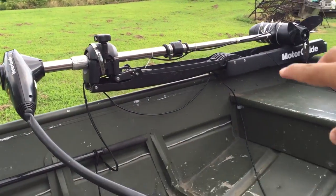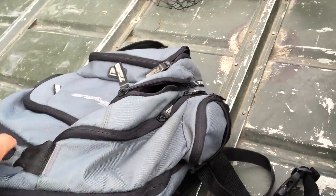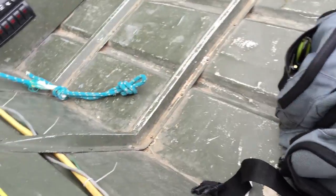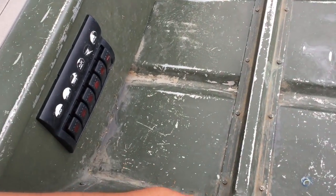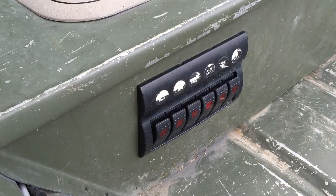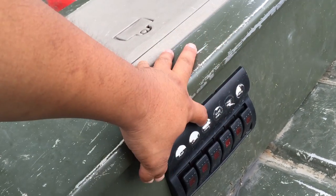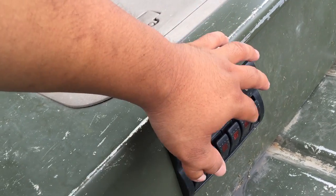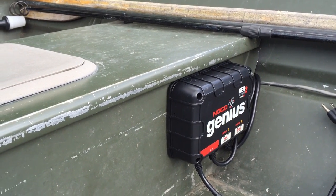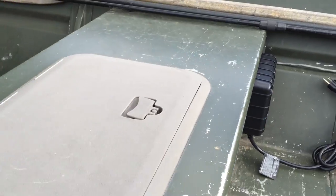For the electrical wiring, the light wiring goes one way and the trolling motor lights and everything else come in through the ribs on the other side. I'm not exactly done with it — I still need to put some wire loom or jackets on the wiring once I'm satisfied with the layout. Here's the master control switch — eight buttons covering nav lights, fish finder power, bilge pump, and additional navigation lighting. I also have a Genius Mini Gen 2 two-bank battery charger. I only have one battery but got the two-bank version since it costs the same.